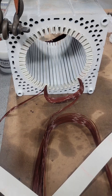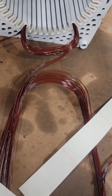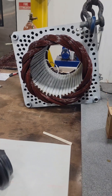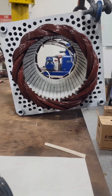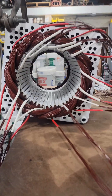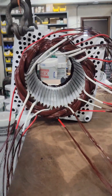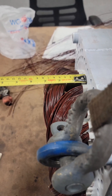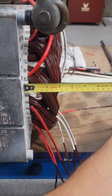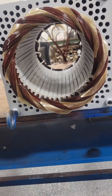I also marked our lead location so that when we're done, we put everything back where we took it from. I'll make a couple of test coils just to see how they fit — these were a little too long, so I'm going to shorten them up and start throwing them into that stator. You can do phase insulation while you're winding or after; I do it both ways depending on the winding. Once all those coils are in, I'll check the dimensions — we really want to be the same size or smaller. Making the winding larger changes the resistance, increases heat, and gives it a shorter life.